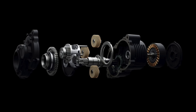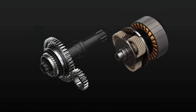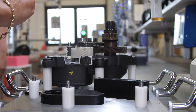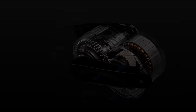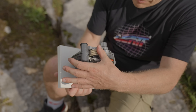So firstly their choice of gears — they chose to use a planetary gearbox, which depending on who you talk to has pros and cons. The main one being more complicated to assemble compared to cascade gears which are in most other motors. These planetary gears give a massive step up and as DJI quote, it's a 1 to 40 — so one turn gives a 40 turn amplification in one hit, where other gearboxes use a train of gears to get to the same multiplication.